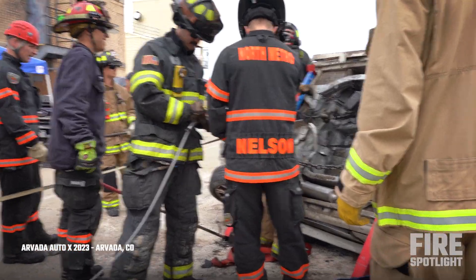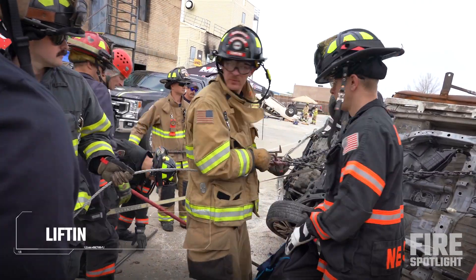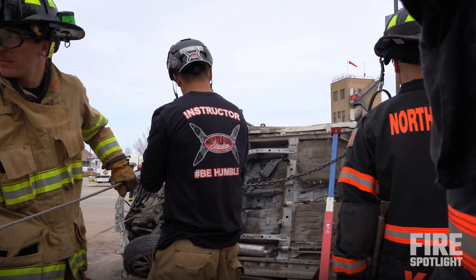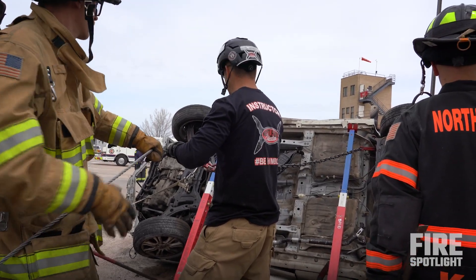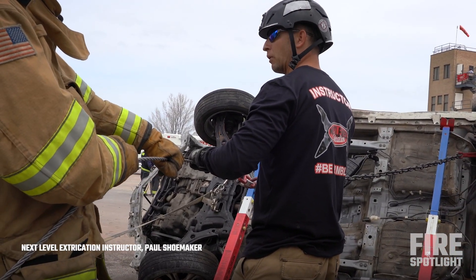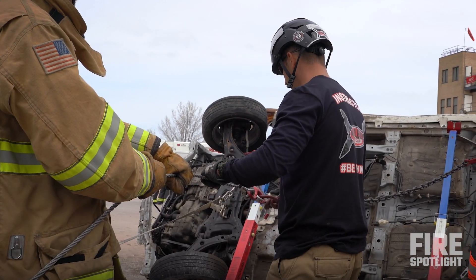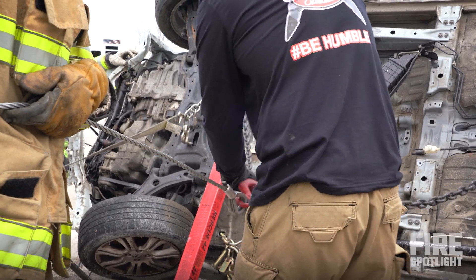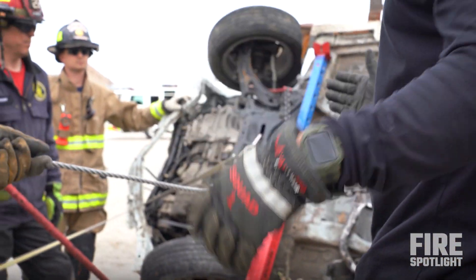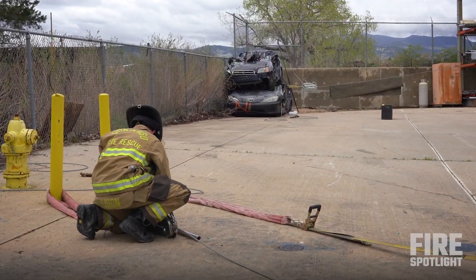Let's get this into the system with those hooks. We put a little tension on it but we're not going to lift it. I want to see what direction this is being pulled and we want to make sure we square up that pull with those chains. If I look right now, I can tell you which one is pulling a little bit more — this one's pulling a little bit more. So it's an easy fix for us to just loosen up a little bit and take this one section of chains. See how you fixed that? Now you're getting equal pull there with equal pull there. It's in line with this grip hoist.